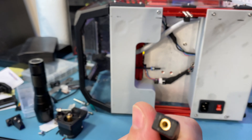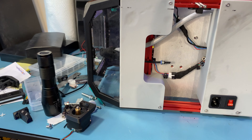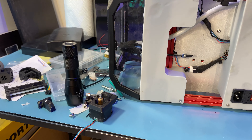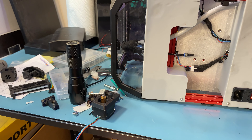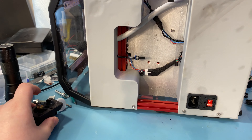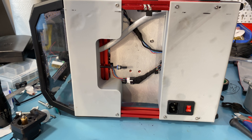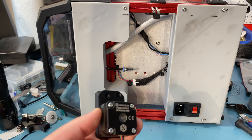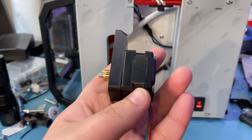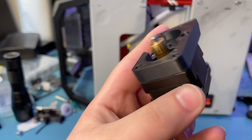I realized the shuttle's threaded insert was loose. I pushed it really in there this time and shaved a bit off from the top, but even that got loose. Before the former stuff, I was feeling that in terms of speed what was keeping me back was the extruder, and also this motor was getting really hot — even before the new firmware you can see that I actually melted a bit of it thanks to the motor's heat.